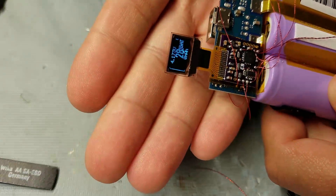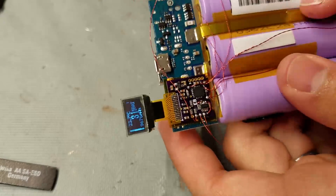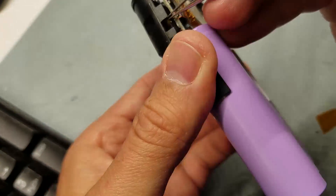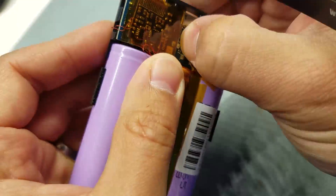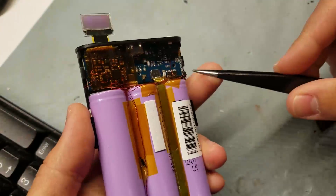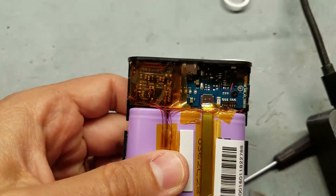For the final wire-in I used very small 34-gauge magnet wire and mounted my board inside the power bank — there's actually plenty of space on one side of the PCB. With a lot of careful tweaking I was able to get all the wires out of the way and snap the plastic cover back on with the display ending up in the right place in the window.